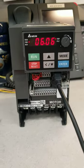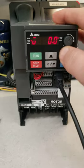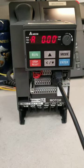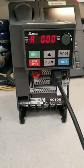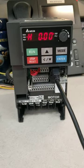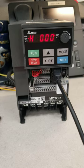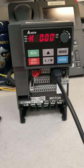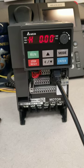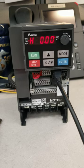Press Enter — that is it. We will cycle power and reset the unit. When the unit comes back on, it will not allow the unit to over-torque. So your maximum hertz could be anywhere from 37 hertz to 59 — it may cut out at 59. But the blower will continue to run. This means you've got to set your airflow to get 60 hertz. 60 hertz is what you want on 100% call on IntelliSpeak. Thank you very much.